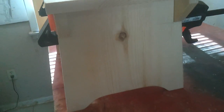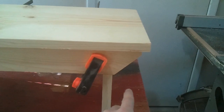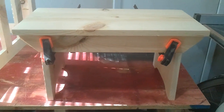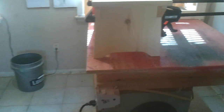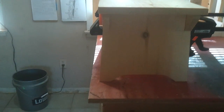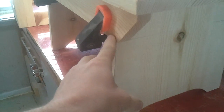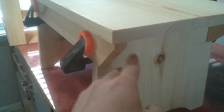I've got the legs cut out and now you can kind of see how this thing goes together. I've got these horizontal stretcher pieces — the leg is offset about an eighth of an inch. The base is eleven and a quarter on the bottom and the top is eleven and a quarter. The legs are tapered in a half inch from the bottom point up to where the stretcher touches, and then it goes in another three-quarter and then up two and a half right in there. That's how this connects.